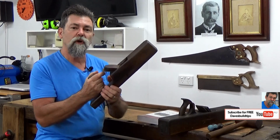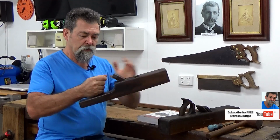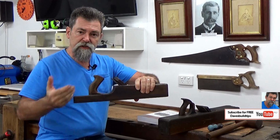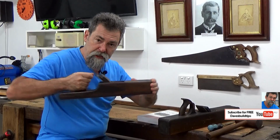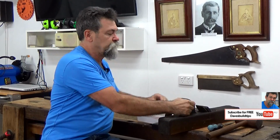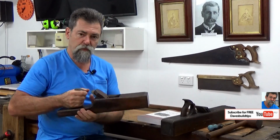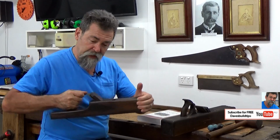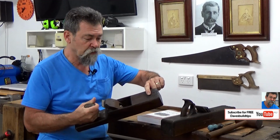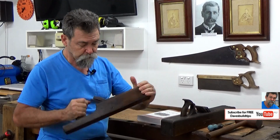The jack plane was used to reduce the thickness of timber quickly. It's only a 17-inch body. The handle is down low, so he could get in behind the push instead of pushing down like this one here. It's pushing down on top. The jack plane is right in behind it. He can really put a lot of energy into the cut. The plane used to have a handle at the front here. Now I've no idea, it was gone before I got the plane.